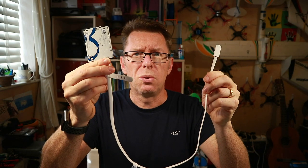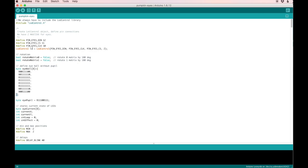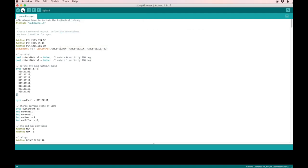All you need to do is connect your Arduino board to the USB cable and plug that into your computer. You need your pumpkin eyes code on the screen — you don't have to do anything with it. What you will need to double check is that you've got the right board selected. I've got my Arduino Leonardo; depending on what board or copy you have it could be something different. And you obviously need the right port selected. On Windows expect some sort of COM port.